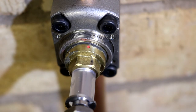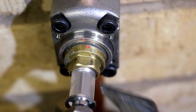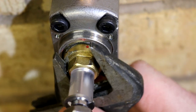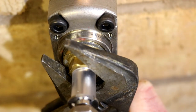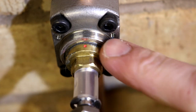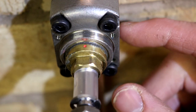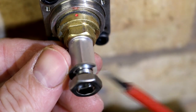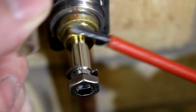Now we're going to manually remove the collar — unscrew it by hand in a counterclockwise rotation. We have to make sure that the two red points line up. Take an adjustable wrench or spanner and turn in a clockwise direction, or back it off slightly to line them up. However, if you are backing it off, make sure you do not back it off more than half a turn, because you may compromise the seal inside. At this stage we can go ahead and remove the poly tube. Do not remove the collar — that must stay on. It's very temperamental, so try not to knock it off.